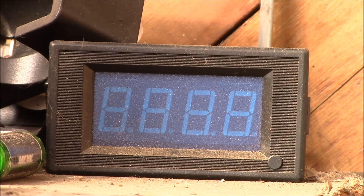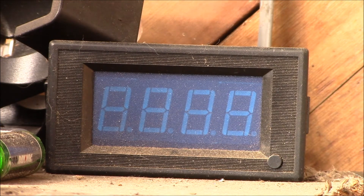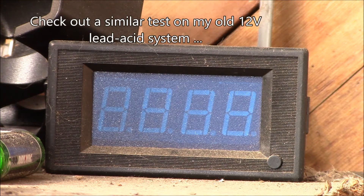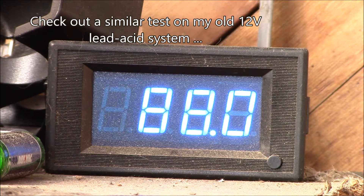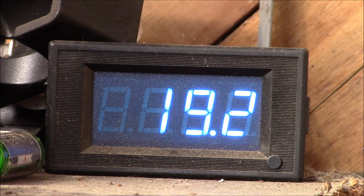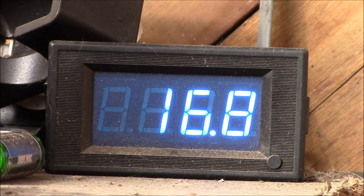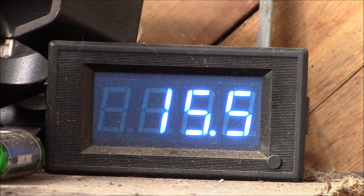Here's the ammeter on the AC power inverter. I'm going to turn it on and that will start running my freezer out in the garage. Let's watch the current spike — yep, it hits about 88 amps and then drops right down. Right now the freezer is using 211 watts and 1.74 amps on the AC side.